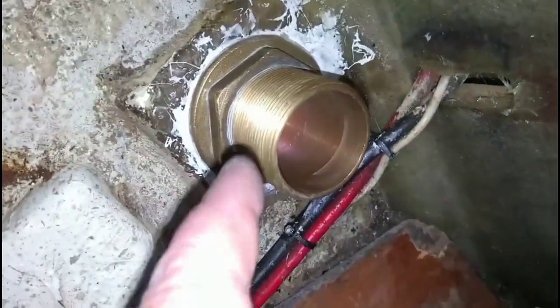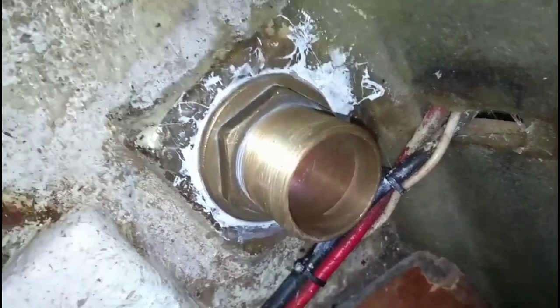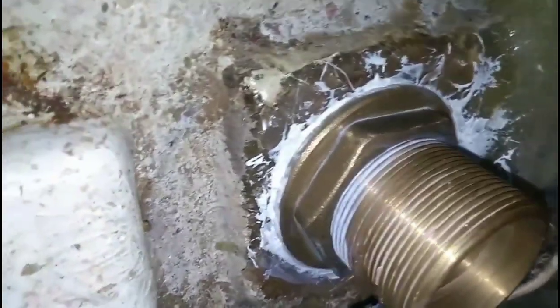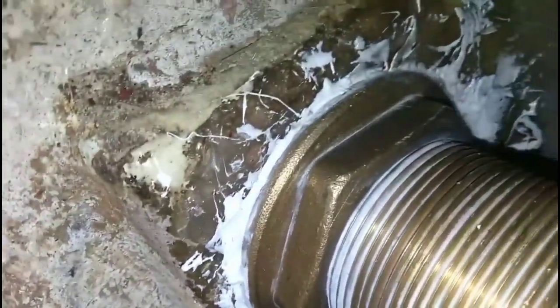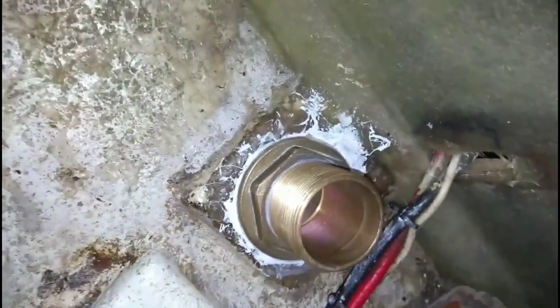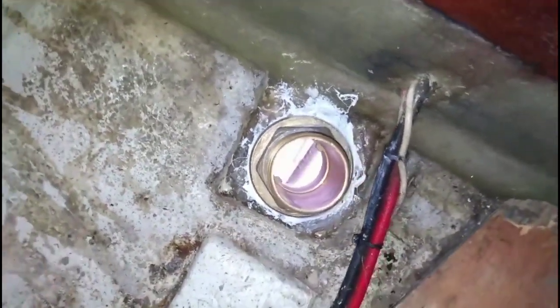What really needs cleaning up is this section here. If you have any of that crap left on there, you're never going to get anything on. You want that to sit there — see how I've got a little bit around the thread? It should all be sealed, and it's all sealed lovely around the end. I'm very, very happy with that. The reality is I'm not going to know whether it works until the boat goes back in the water. Luckily, that's not today. I'm going to leave that now, just let it seal, let it go off. I've tightened it as much as I can. Some people say leave it for a day then come and tighten it up — no, I do it straight away, bang. Get it nice and tight. I don't want to have that spinning around at all. So that's one through-hole fitting in.